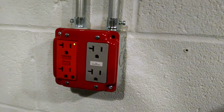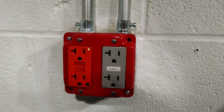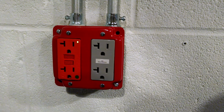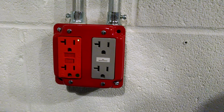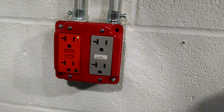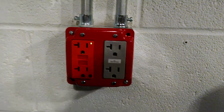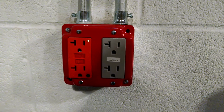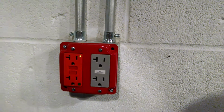And the cover I sprayed with Rustoleum's galvanized approved universal bonding primer, which has a really good tenacious grip on galvanized. So good that you can actually paint it and then rub it with mineral spirits, and the galvanized primer won't come off. So it's definitely on there real good. And you know how galvanized looks like crap after a couple years, so put some enamel on it. Once it cures, it's actually pretty scratch resistant. It looks a lot better.